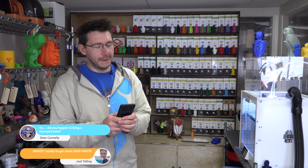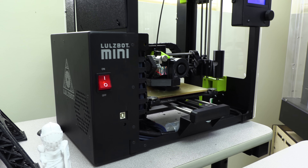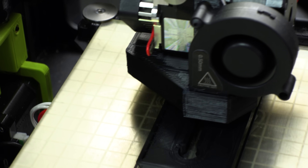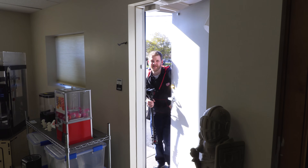I didn't bring mine either. Let's just 3D print one. This is a good idea — we have 3D printers, we have these tools that make things. So I set it to print on the Lulzbot Mini 2. Here it is — this piece right here is a Manfrotto tripod camera adapter, printed in PLA. It should work just fine. We need the monopod here in order to try it out. We can get a quarter-20 screw for the camera. Once Sean gets here, we can try it out.